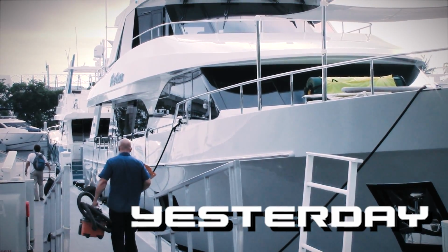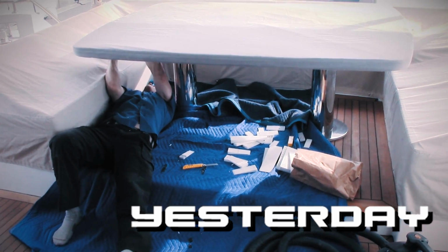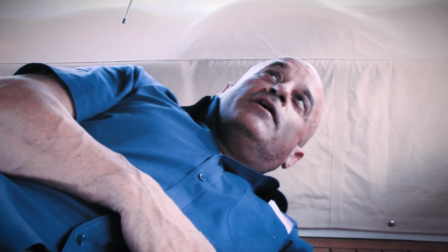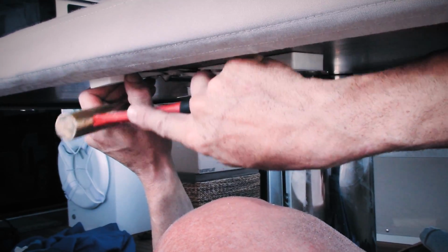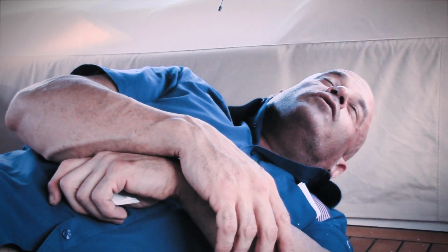This is an aft deck table on a relatively expensive yacht. They get 64 truss head screws going from the stainless to the bottom of the table. Some dumbass decides to use 5200 on top of the screws. So let's glue all this stainless down on top of a veneered table with 5200. This is the exact wrong use for the material.